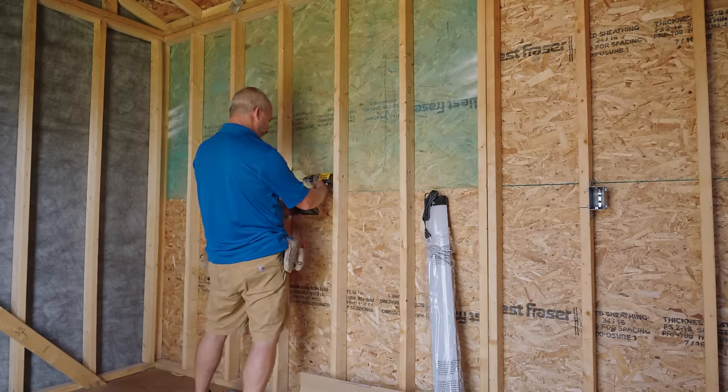Now, in this case, let's start off on the black side. Because now, what we're doing is just completing a circuit where the black and the white both come in the bottom, and they come out the top, because these tabs are still intact, okay? So we're going to go power in on the bottom. Sorry. Pinch that together. Okay. Power out on the top.